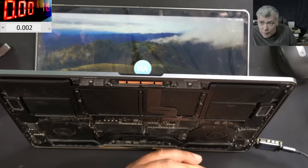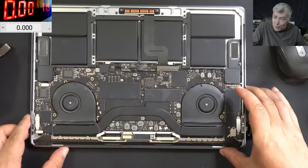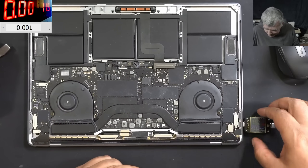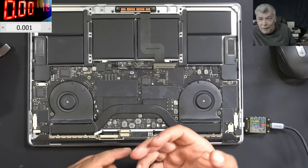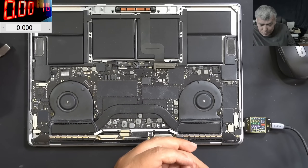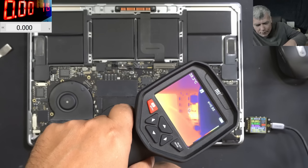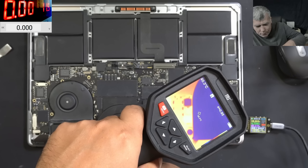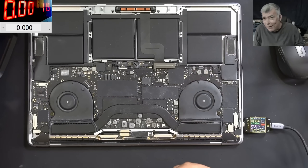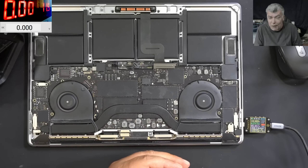Then you have to be lazy — the job is too cheap or you are lazy. So you can try to blow up the capacitor instead of taking out the board, removing the capacitor, that kind of stuff. You can come in with high current. This was a lucky case because the capacitor had quite high resistance. When the capacitor has a high resistance, it will take a lot of power. We start pushing some current and the capacitor blows up. Now in this area everything is fine — it's just normal, normal use of the laptop. Don't blame me, I'm just trying to give you another way to fix a laptop when you have limited time.